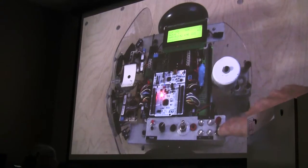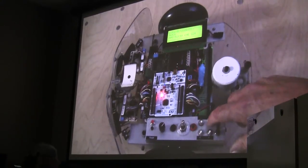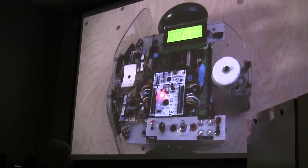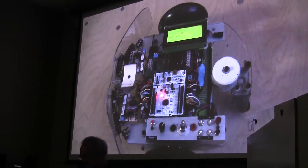And we'll go back. Actually, I think what I do is we'll just go back to the parameters. And we'll go back to the beginning. Is there anything else about that? So you have basically two menus where you can edit. You can edit the flags menu to turn subsystems on and off, and you can go to the particular subsystem and edit the values within those. When you hit reset, what you've added remains. It doesn't change. The BSS segment is still cleared.